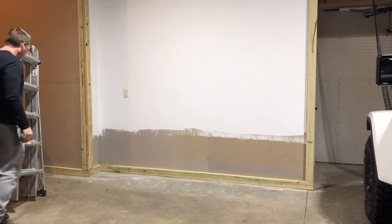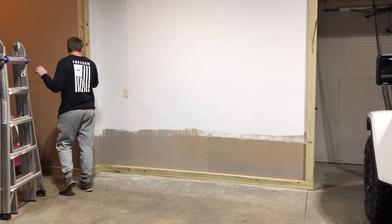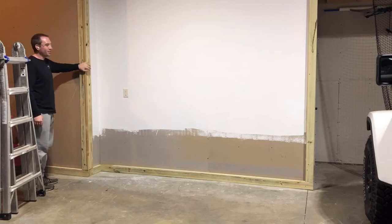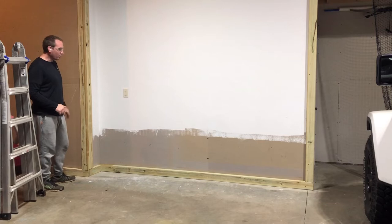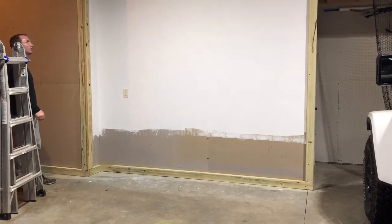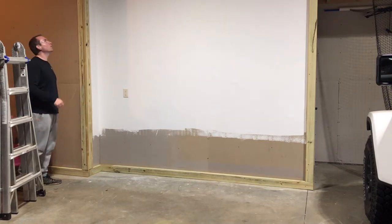I have to say that turned out pretty good — I'm happy with that. I never really saw this corner plating done before, but it's obviously extremely sturdy using these 2x4s. Nothing is going to destroy this corner now. I just need to get the metal on, finish the top rail, and then obviously finish the rest of the drywall in the garage. Got a lot to go, but off to a good start — I like this concept, so I'm going to keep moving ahead with it.